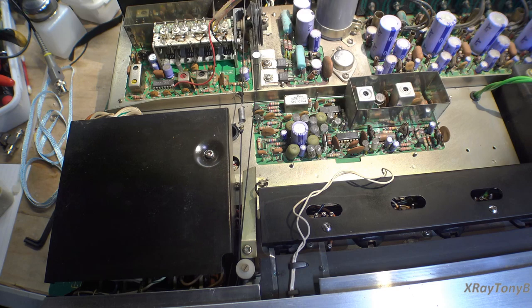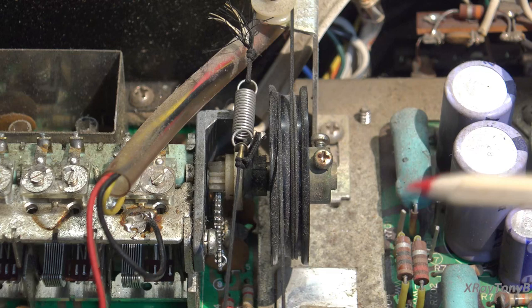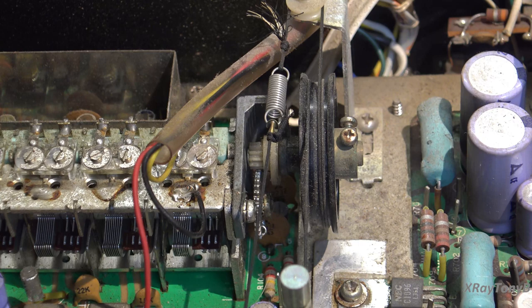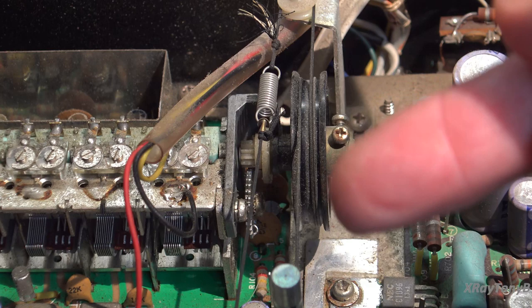To fix this, there are a few things to know. On this little plastic gear, there's a tab that sticks out — a stop — that will hit a little metal bracket at each end of travel. You want to get it to the end of its travel in one direction against the stop, then move your dial pointer just beyond the dial scale. In this instance, it's turned all the way to the highest frequency, 108 MHz, rotating this way, so the tuning gang gear has to be rotated all the way in that same direction.